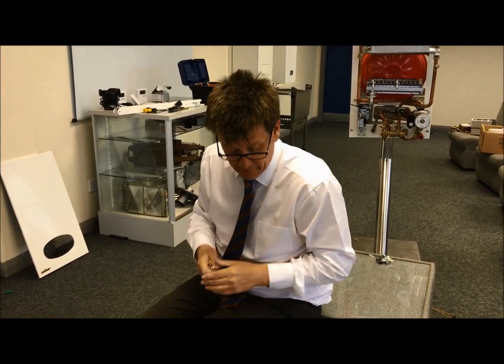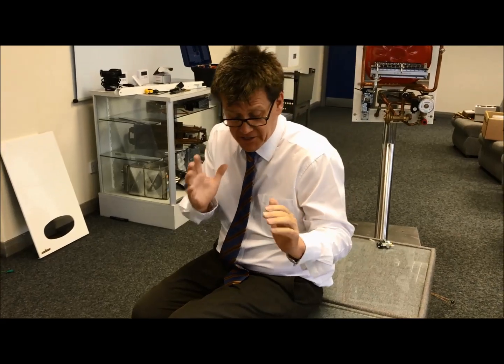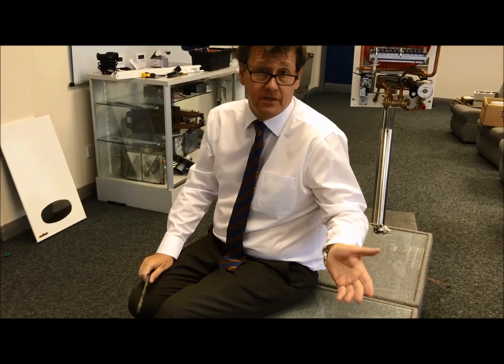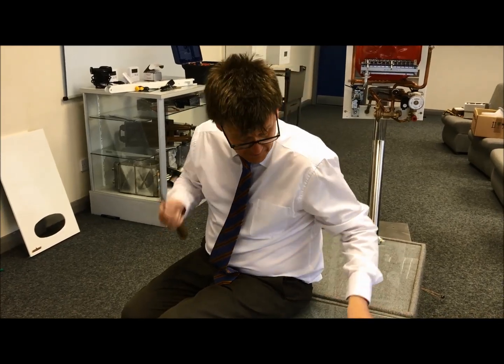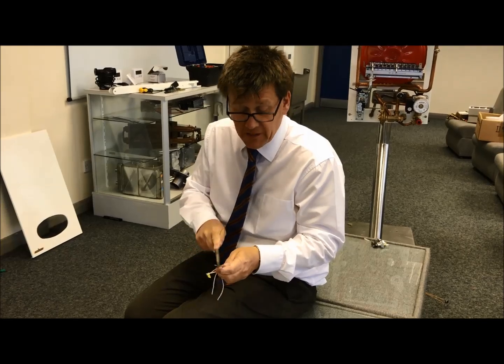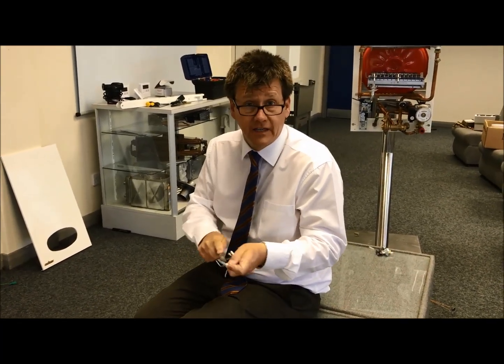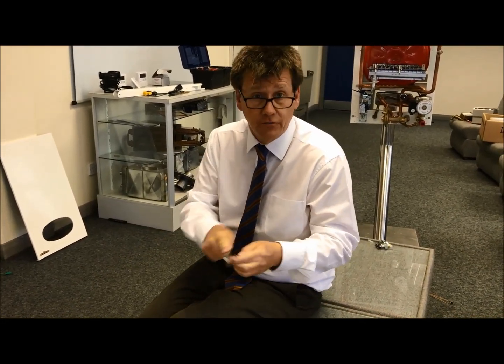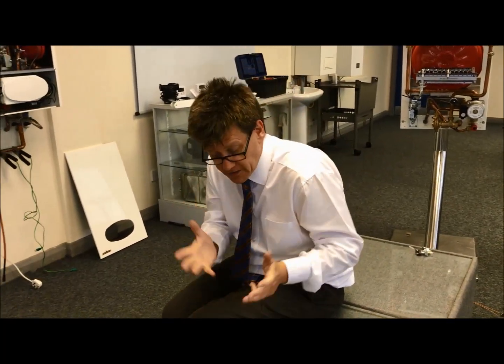To service these it's dead simple. You could rub all week long with steel wool and you would not clean that carbon off. Get yourself a meaty file — at year three or four, just give the electrodes a good file, and give your rectification probe a good file too. It's as good as new, no need to replace it. Make sure your seals are okay. If you do get aggressive ignition, that's your solution — build it into your service routine if you're not already doing so.